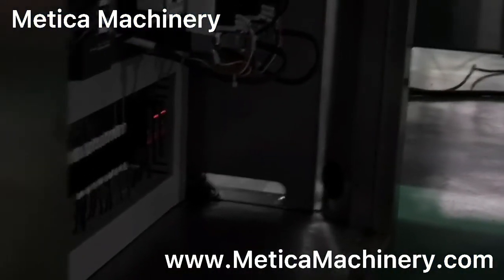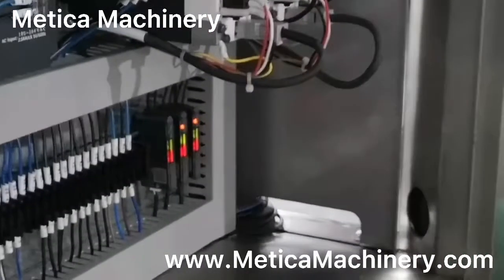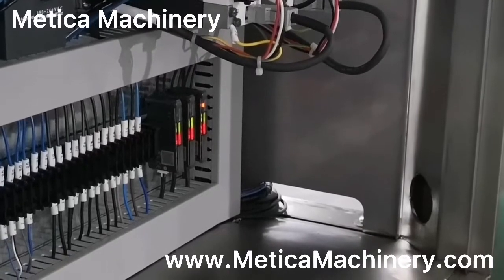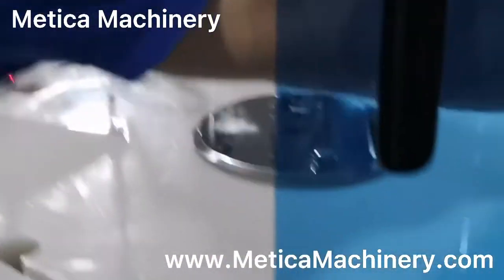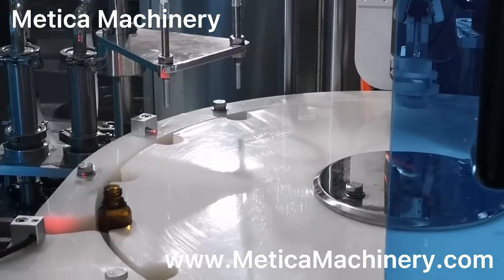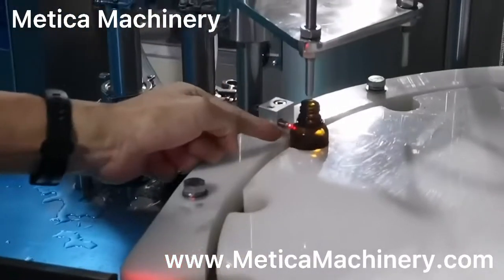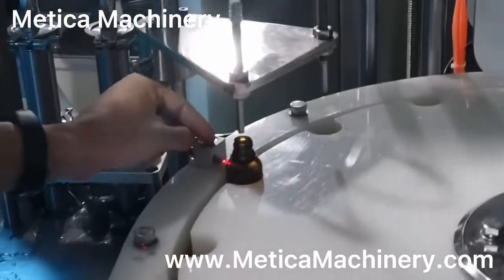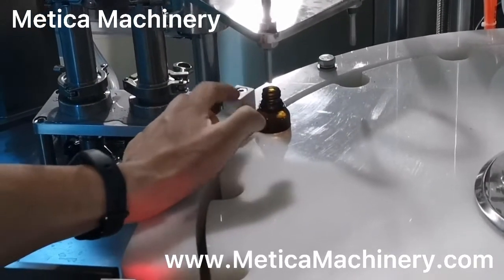Yeah, that sensor, the right one, I think, is the sensor for this protective bottle. Sensor, you know, we need to keep it in position. Okay, this angle, this distance, here a screw, you know, we can unscrew this part to pull it out, or this way, to make sure it can properly detect these bottles.